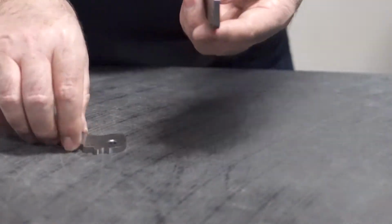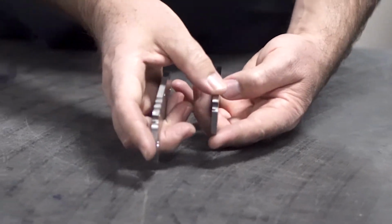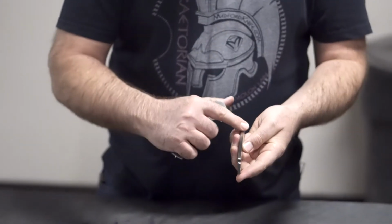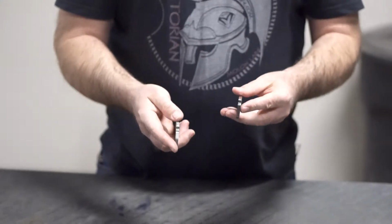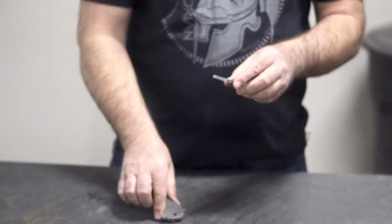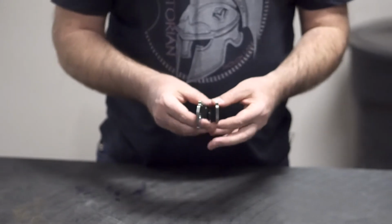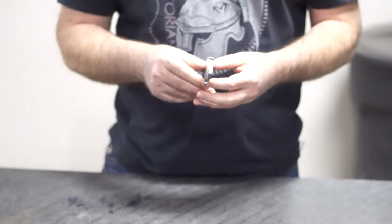So you can see here, if we get a close-up, or if you're able to focus in on these, you'll see one that's very reflective and one that's not reflective. This one's got the tapered edge or the kerf of the water jet on it. This one's got this machined edge, perfectly square. Either one of these are still no good as a knife part because they still have to have all of the interactive part that meets your hand. It's all got to be contoured and shaped, chamfered, and cleaned up. We do a lot of knives this way, and we do a lot of knives this way. So it'll go through one of these two processes.